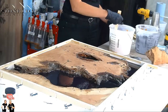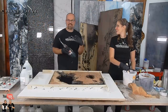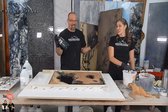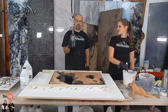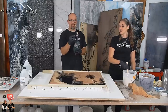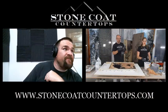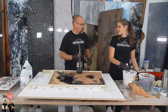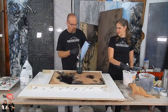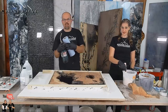Okay, I have a pro tip because I just went out to our torch stash, and we just taught a class this last week, and our class, they like to make a mess, right? We get a pretty good mess around here. We have a bunch of these torch heads, so I was going through them, and the first five that I grabbed, this was locked. That's because we forgot to go through after they used them and cleaned them. So you wanna wipe your hands really good with a paper towel. Before we grab our torch, like when we're working a countertop, grab your paper towel, wipe your hands, and then operate your torch, and you won't get that button stuck.